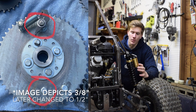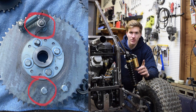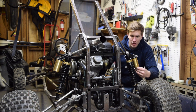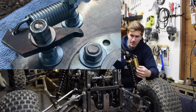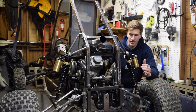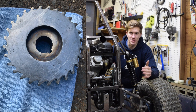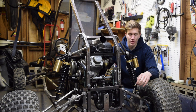I drilled half-inch holes, one on each side of the sprocket, and ran a half-inch grade 8 bolt through — that's very important, it had to be a very strong bolt — with washers. That essentially held what I call the bird's beaks, because that's kind of what they look like. It's essentially just a ratchet which is spring-loaded to another bolt running through the same sprocket. There's one on each side of the sprocket facing opposite directions, each going to a slightly modified drive sprocket on the left and right sides, with the teeth beveled and angled to add extra stability when engaging.